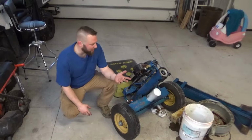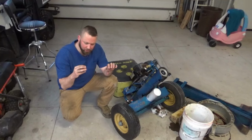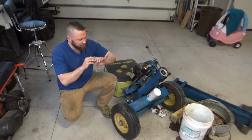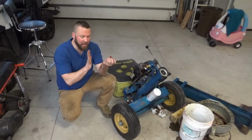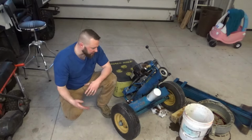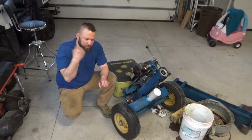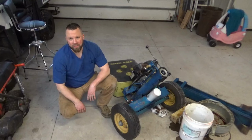All right, guys, there's a reason why that log splitter wouldn't retract. The back of the cylinder, we heard it rolling around inside of the cylinder, must bolt onto the rod, the ram, and when that unthreaded itself and fell off, there was nothing there to catch that hydraulic pressure to push that back into the cylinder, so. I have to get a slide hammer. That's the only thing I can think of to drop the jaws down in there, grab that, and pull that sucker out. If you can think of another idea or know of one, leave a comment.